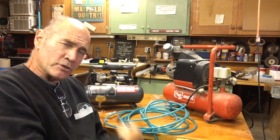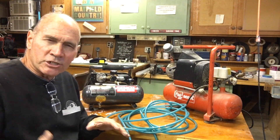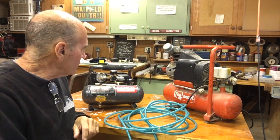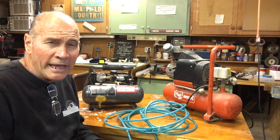The first thing you're going to need when you start buying stuff is obviously a compressor. I suggest you don't get the package deal they sell at Home Depot or Lowe's — buy things individually, because there are different features on different brands that you'll like. These two have served me really well. I got this one called the Finney Scout — kind of hard to find, but you can find it online. I like the size of it and I can lug it around easily. This little guy by Senco has been great — it's super quiet and super light.